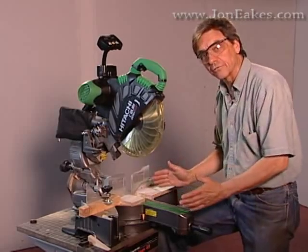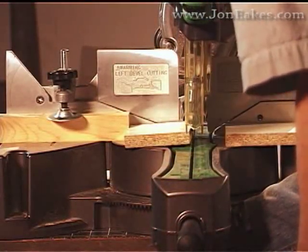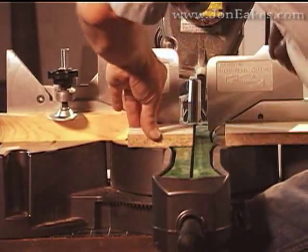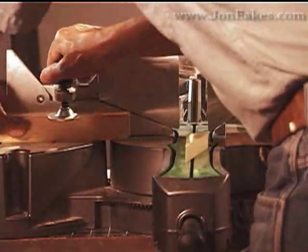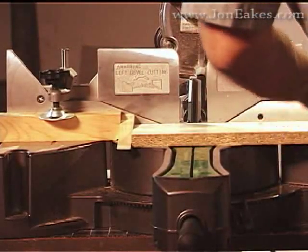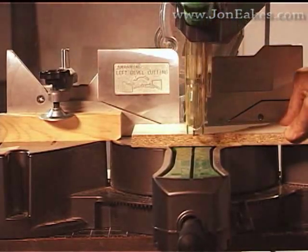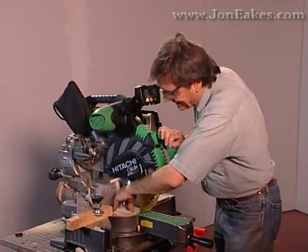End stops can be very useful for repetitive cuts, but they can also be very dangerous. Here's the piece of wood cut through this end stop, and as I'm coming up, see how it's catching there and binding? If that is allowed to bind between the blade and the stop, it not only messes up the cut but can grab the piece and throw it right into your face. So either you hold it firmly down or use a clamping arrangement, or we change the game — we move the end stop a bit further and insert a spacer. That's my real dimension; I come up to it, then remove the spacer. Now the piece is free and not bound between the stop and the blade, and I can hold it safely. End stops should never allow the piece to be bound in unless it's clamped.